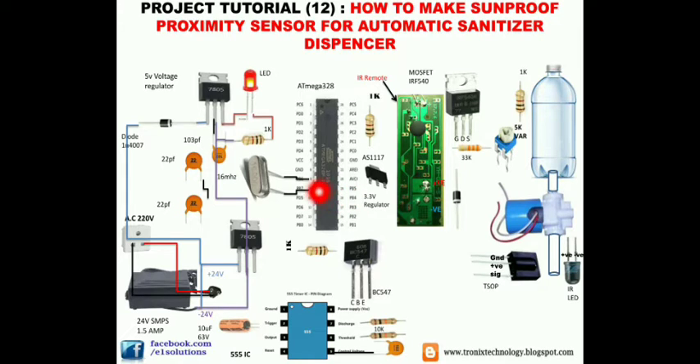Connect pins 9 and 10 of the ATmega328 to the crystal oscillator — pin 9 to one end and pin 10 to the other. The crystal oscillator is used to generate the clock pulse. Connect each leg of the crystal oscillator to a 22 picofarad capacitor. Connect pin 8 of the ATmega328 to ground (middle section of 7805), and connect pin 7 to the positive 5-volt output (third pin of 7805).